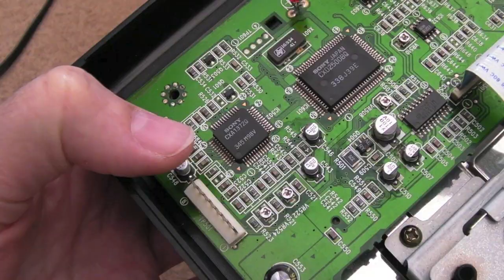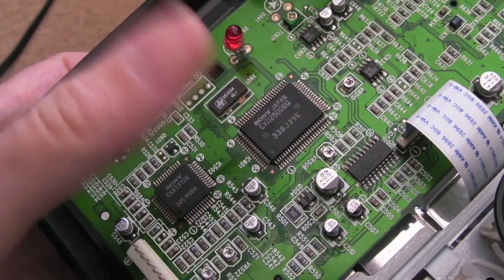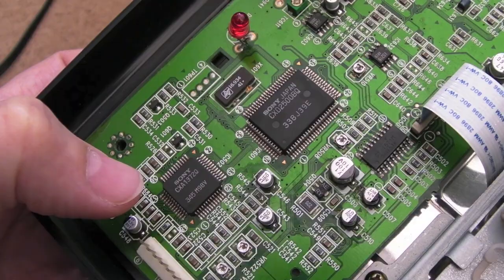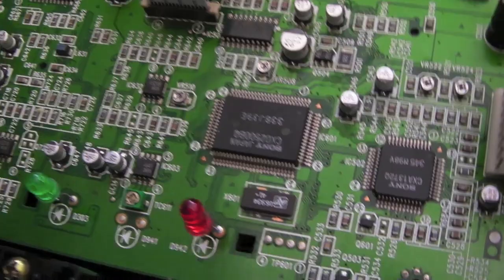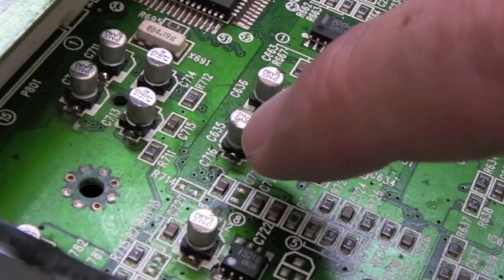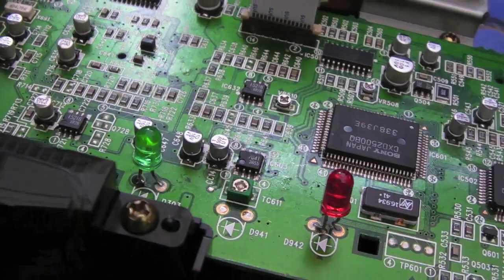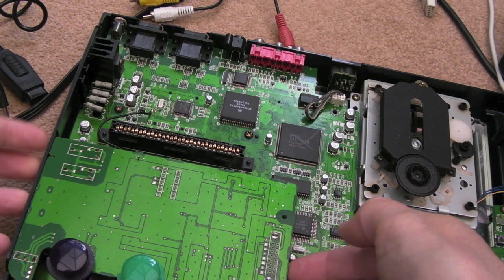I'm just looking at the solder — someone's been tinkering with the solder on that switch. One or two of the chips on here I have spares for, actually — a CXA1372Q, which is quite a common chip on a CD drive chipset; might be an RF amp or something like that. I'll be wearing my ESD wrist strap because I don't want to take any risks with this. If you look at this in the light, you can see how dirty the board looks. It's going to need a really good thorough clean with some vinegar and IPA, then close inspection of the capacitors, re-soldering the odd solder point, and fixing any corrosion we find on the way.